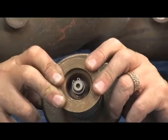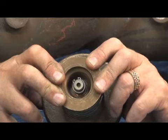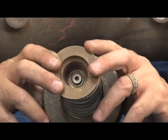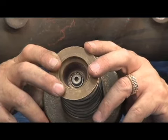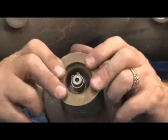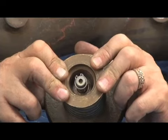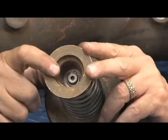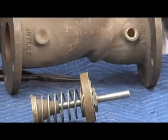Watts uses what's called an E-clip. And an E-clip is a small little metallic piece that holds that spring retainer, just like a fastener would. And when it's properly applied, it is extremely strong, actually stronger than a fastener would be in that particular location. But believe it or not, this E-clip can be improperly applied. And because of that concern, Watts makes it, like it said in those directions, do not disassemble, because they're afraid you're going to put this E-clip on incorrectly. How can you put an E-clip on incorrectly? Well, let me show you how an E-clip works.